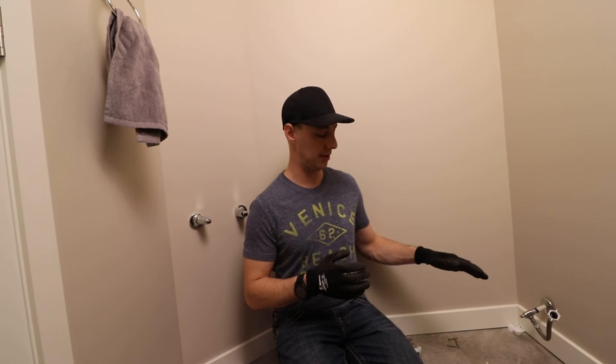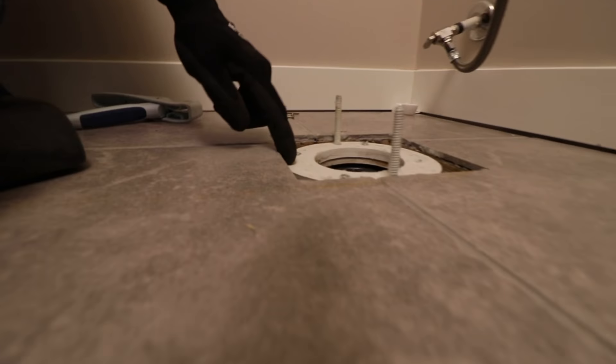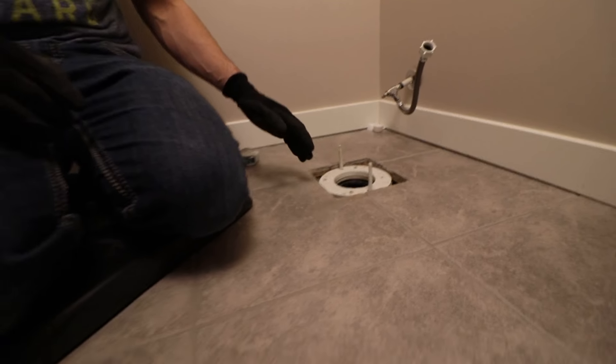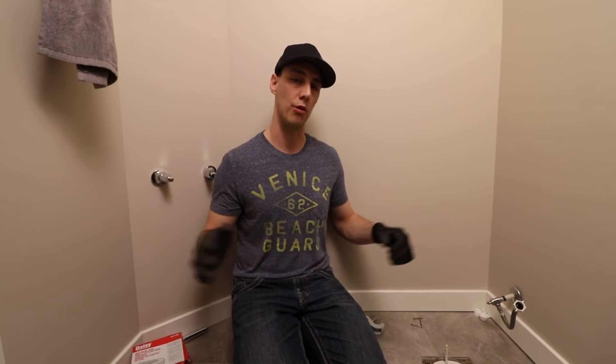The reason we're going to extend this flange is that the flange itself is sitting below the floor. Come down here and take a look at why we're changing this. If you look here, it's sitting a little bit lower, so if you go to put your horned wax seal on it's probably going to be too low. A lot of times guys will just put on another wax seal without a horn — they doubled up the wax. There's nothing wrong with it, but we like to do the flange extension to add more assurance that it's fully sealed, not just relying on the wax.